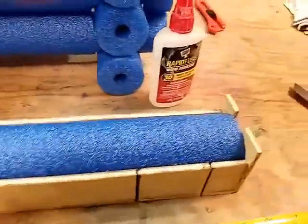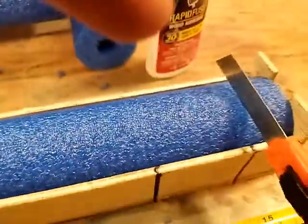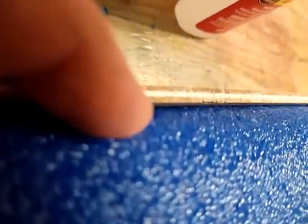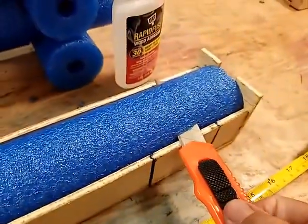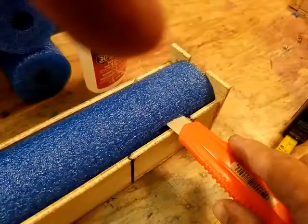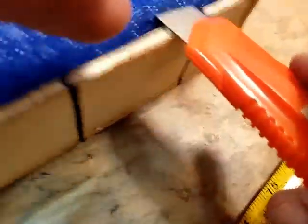And then you make your cut, like right here at this slice right here, head on. It's just straight across there, 1 or 2 little bitty cuts. So you cut this one across here and this one across here, and then you take it and you just go across with your knife like this, and the blade comes out on the other side, and you just kind of saw it across there. You turn your blade over and come back, and you come across this side here, and like that, and you use the 2 edges of the plywood as your reference for the thickness of it, and then that just comes out like that.